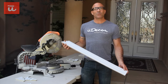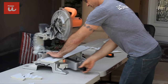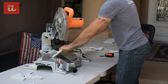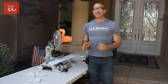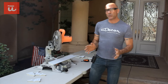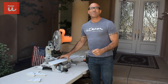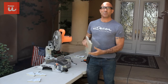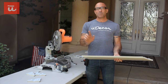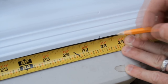Let's get these three pieces cut. We're going to use the leftover piece from our very first cut to create piece number seven. The left side of the piece is going into a 90-degree corner, so we're going to slide the saw over to the left 45-degree miter angle and make our cut. Now we need to cut the right side — the cuts going around that bullnose are all going to be set at 22.5 degrees. We also have to remember that this is an outside corner and not an inside corner. When cutting an inside corner, the bottom of your molding will always be longer than the top. When cutting an outside corner, it is the top that will always be longer. Either way, the measurement we take from the room and mark for our cut will be at the bottom of the molding.